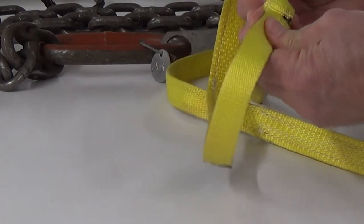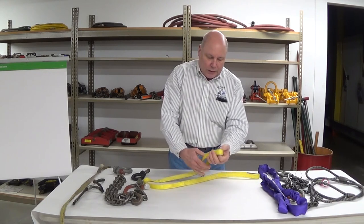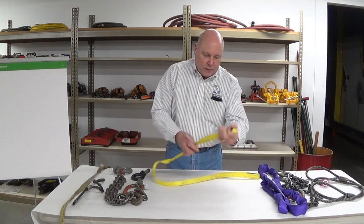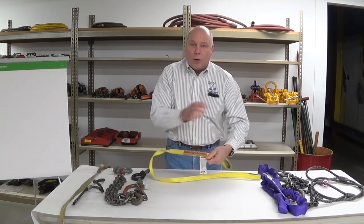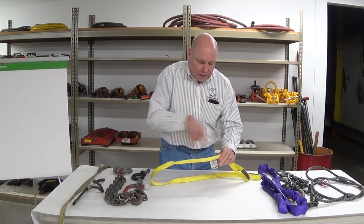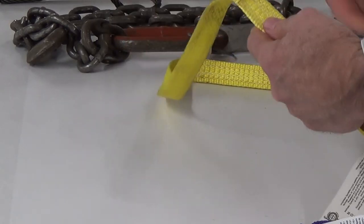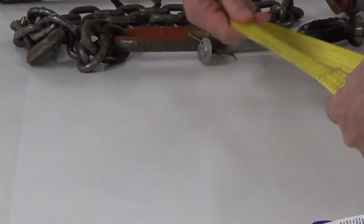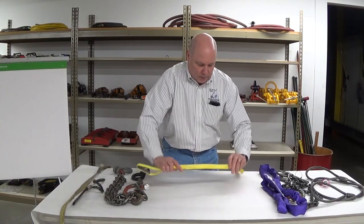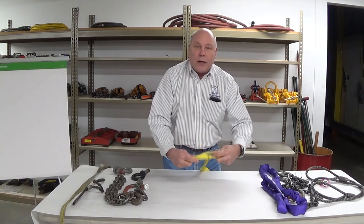I'll be looking for any broken stitching, cuts, crushing, pinching, broken or torn snagged yarns and fibers — all faces, front and back. Then I'll work my way right down the sling, rotate and inspect, sweep with my eyes left and right, back and forth. I'll come down, look at the end of the splice, making sure I'm not losing any stitching there, then roll and continue on to the next splice and work my way right back up to the other eye.